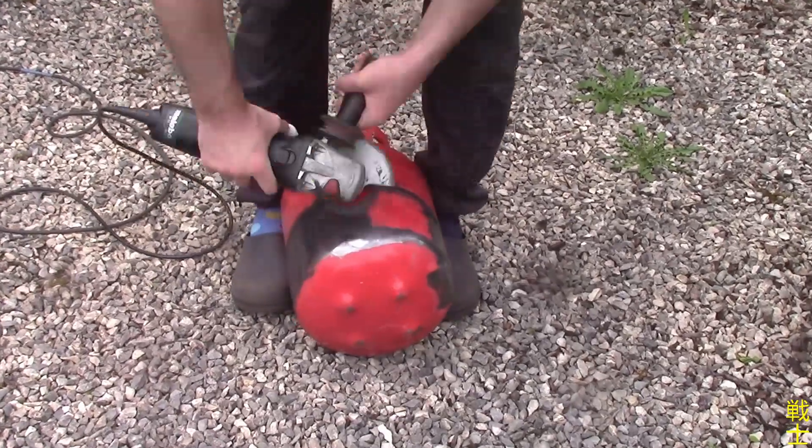Let's set it up. With the stopcock closed, I open the regulator and adjust it to about 0.1. Then I take a piece of paper from the trash can, light it up and make sure it burns very well, put it in and stuff it into the oven, and open the stopcock. With the flames pouring out the sides, I open and adjust the air vent, and the forge is ready for use. It's also possible, once the air vent position is found, to leave that open and just fire it up.